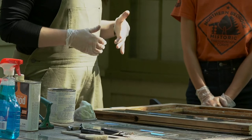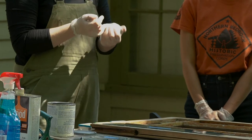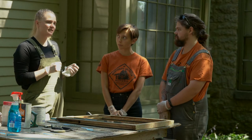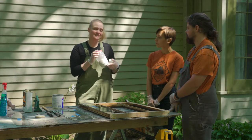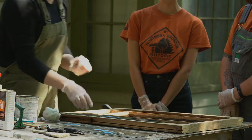There are other types of glazing putty. Today, because of its more rapid paintability, we are using a type called Glaze All. With linseed oil based putties like Sarco Glaze, you can rehydrate them by adding a little bit of linseed oil. If it's too sticky, you can add something called whiting powder, which is basically calcium carbonate — you can find it at ceramic shops or even some paint shops.